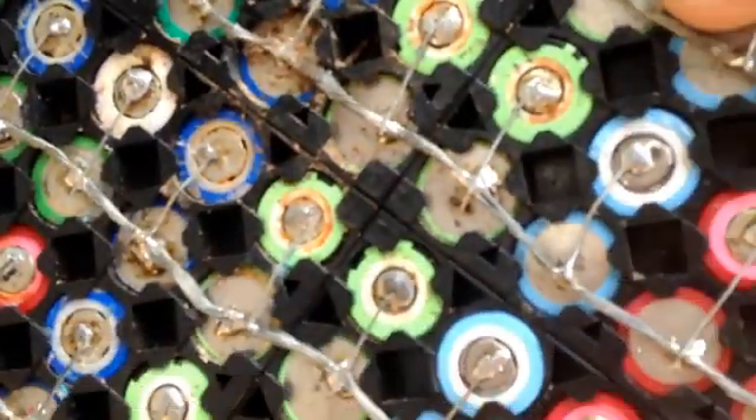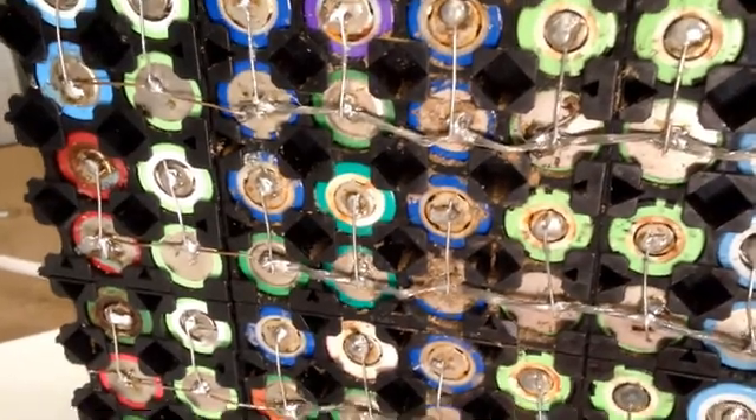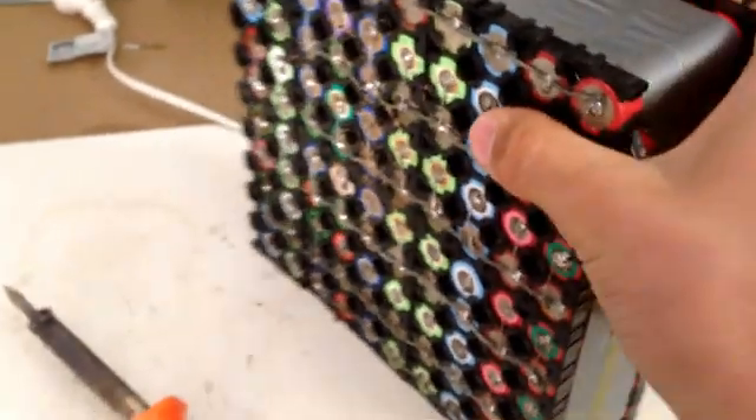You can see there's a lot of stuff built up. It's going to have more cells, high density in milliamp hours, and overall just a lot better than the pack I already have. We've definitely got a lot of sand in there, so that's not good. We'll do a voltage test first just to see if that sand has added any resistance or stopped the fuses from connecting properly. We'll get a voltage reading of every cell — there are 10 cells in series, so that's going to add up to 36 volts at nominal voltage.